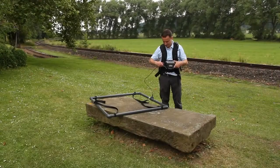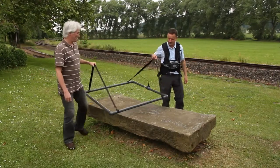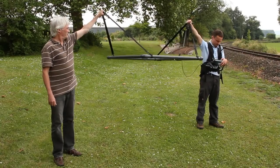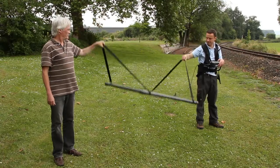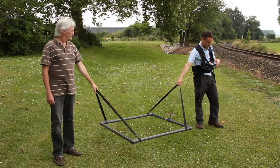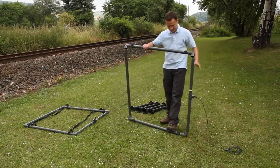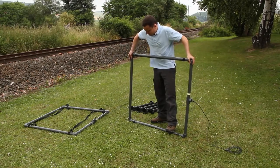If by chance the unit was tuned above a buried metal object the whole tuning process must be repeated. The detector is now ready for use and the coil can be moved from side to side in a systematic manner. The ground balance tuning process must be followed with both large and small coils in the same way. This is essential to avoid false ground indications and misleading metal identification. In any case where no ground balance has been performed, another coil was connected, or the detector has been turned off and on again, a preset ground balance setting will make sure that the detector works well on most types of ground conditions.